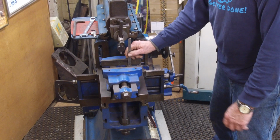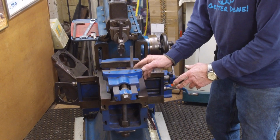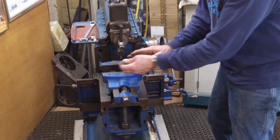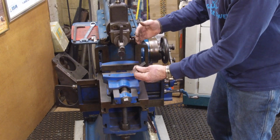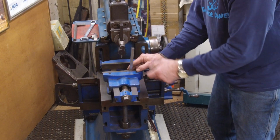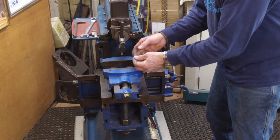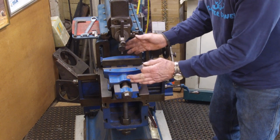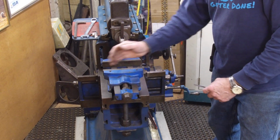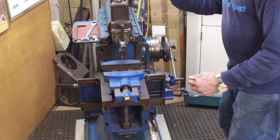So to stand up that 6-inch piece here and have it basically go like that with every pass, we're going to rotate this thing sideways so that we have the whole length and the leverage of the whole part carrying the load of the chip. And instead of a little 2 3/4 inch cut flexing this whole thing at this height, we will be traveling 8 inches and taking less as far as how much the cut travel is. Cut travel side to side, depth will be in the vertical.